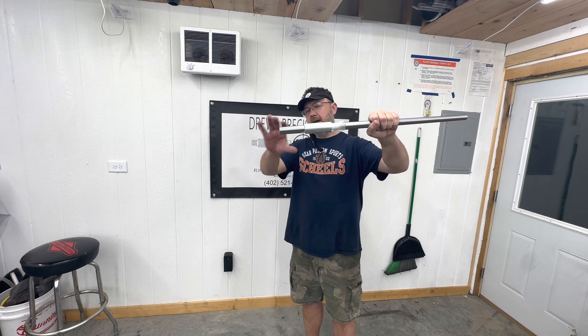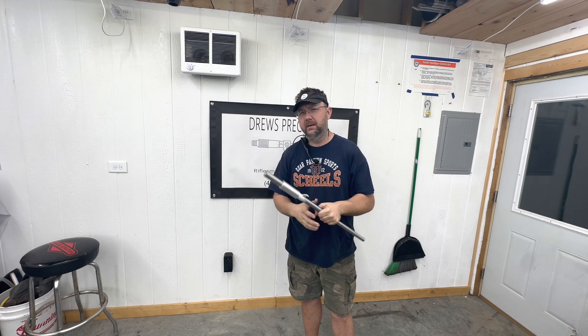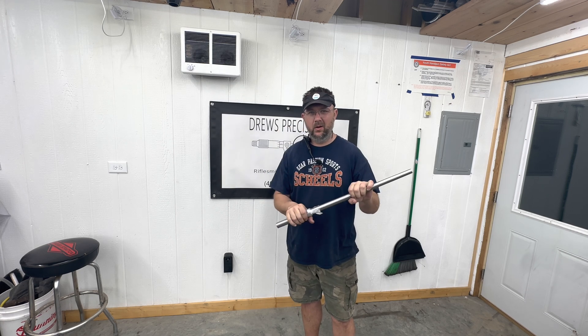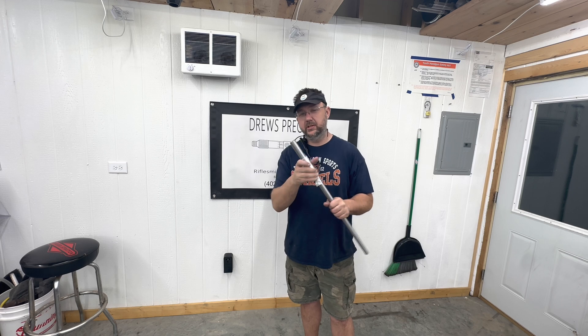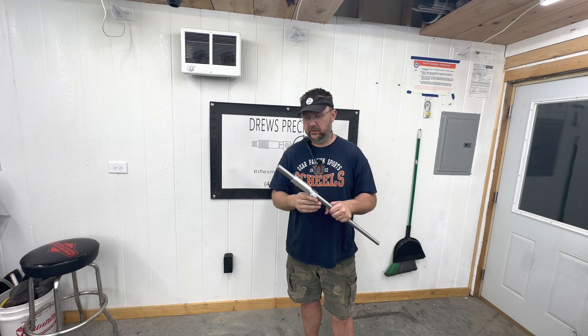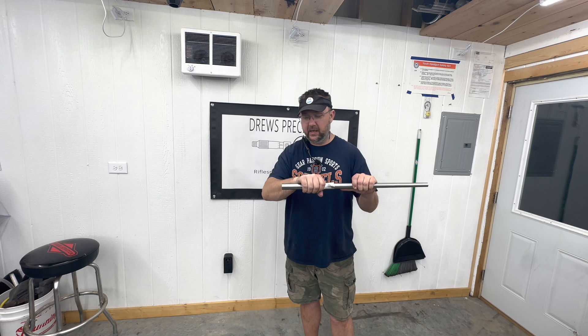We're going to wrap this one up. Hopefully you guys enjoyed following along with how I make these sleeves with the taper that matches the barrel. Hopefully you can understand the benefits of using this over a piece of copper wire, a blueprinting jig, or something like that. This holds the barrel much more rigid than anything else I've found. This, coupled with the true bore alignment system from Straight Shot Gunsmithing, ensures that once we get it indicated to the bore it's not going to move — we can beat on it, abuse it, and our work stays true. Hope you guys enjoyed it. Like, follow, subscribe — until next time, God bless.